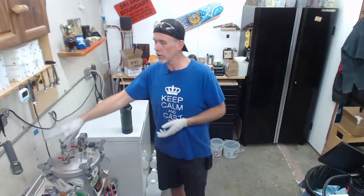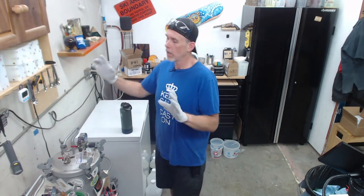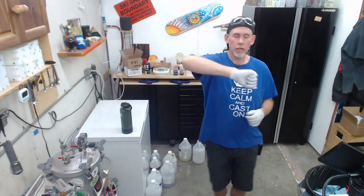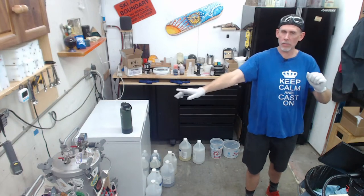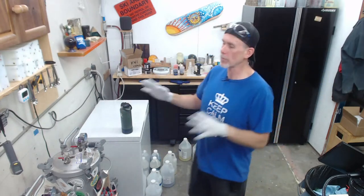The other thing you can do, if you want to get into this but want to stay the heck away from it, is put the pressure pot in a box or something and get a long hose, so the on and off switch for the air, or the ball valve, is much further away. If you really don't feel comfortable near a pressure pot, you can put it somewhere else and operate the air from far away so it starts filling and you're not anywhere near it. It's something to think about. There are ways to get around it.